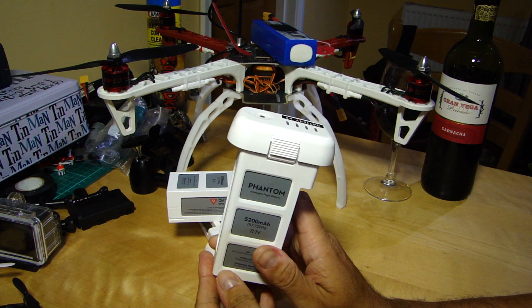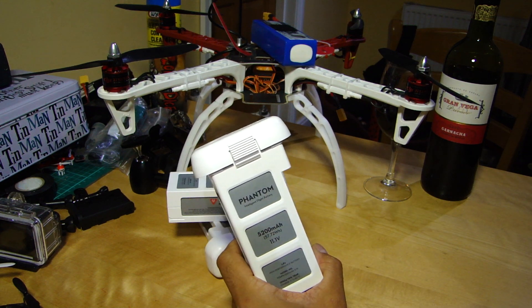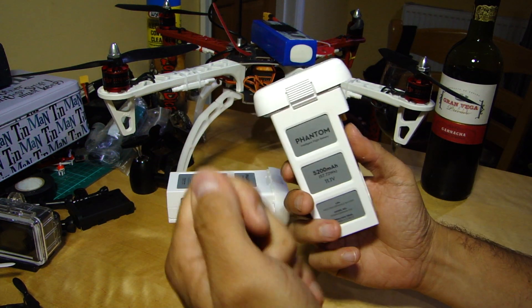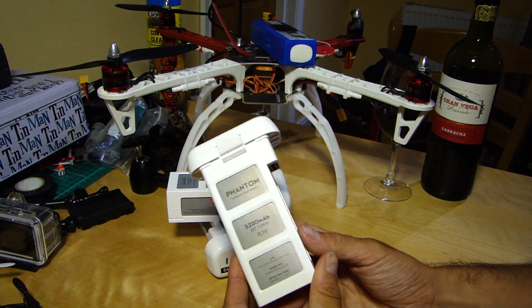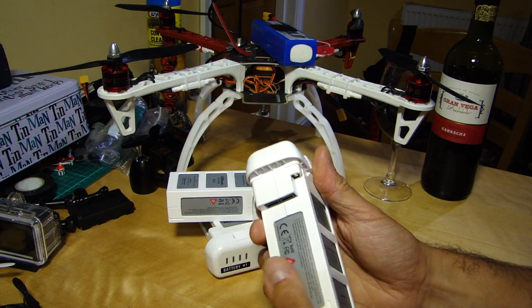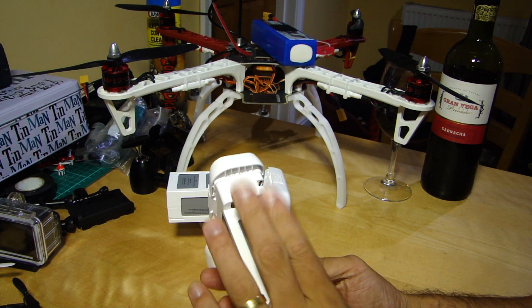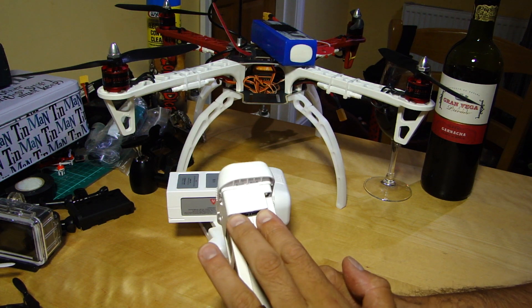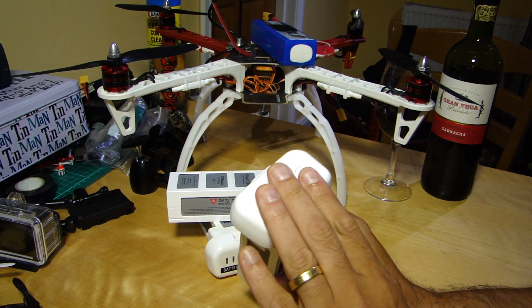So what makes this smart from DJI's point of view is that they've done away with the necessity to have a separate specialist charger with a balancing port, and remembering to plug it in, and what button to press for a balanced charge. Because basically they've built all of that into the battery. In there is a chip which handles all of that, which means that the charger that comes with the aircraft is basically just a power brick — it just shoves voltage in there and the circuit inside handles all the balancing.